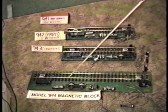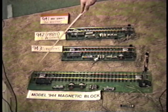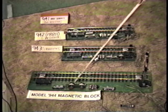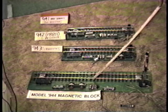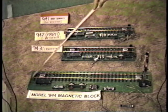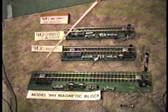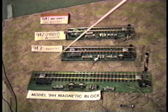It has basically two rheostats, the rear rheostat to control speed back here in the slowdown section, and the forward rheostat to adjust the voltage in the on-off section. Again, just reviewing, this rear rheostat controls the slowdown section. Its purpose is to bring trains into a red block at reduced speeds.